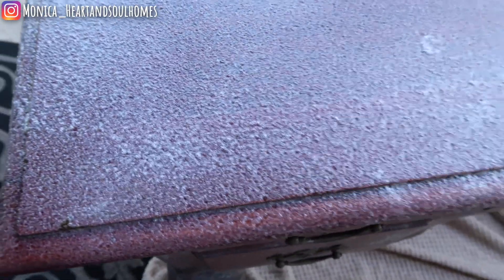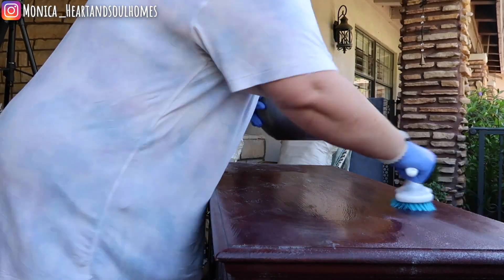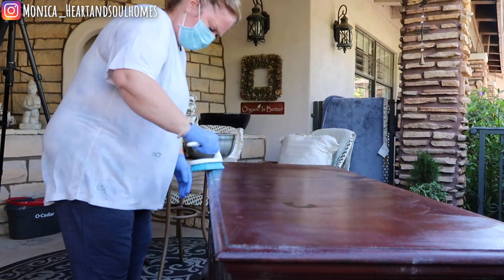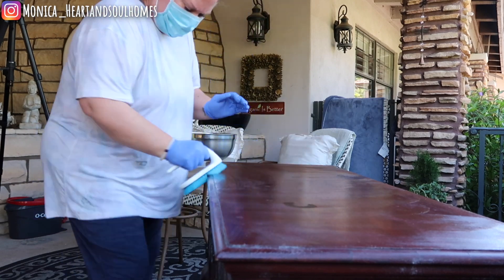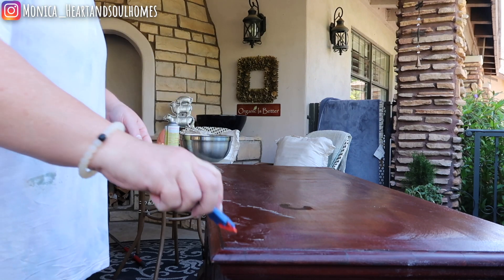The process I used — I've never done this before, this was new to me — is I would drench it all over the wood. This is a very old piece and I wasn't sure about the varnishes used back then. I just drenched it and then I would wait, let it soak in for a couple hours, then come back, spray it down, scrape the stain and varnish off, and just repeat.